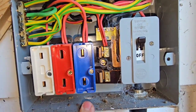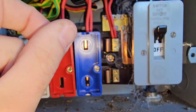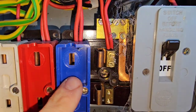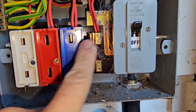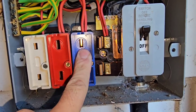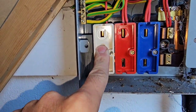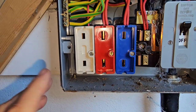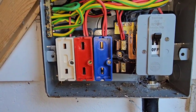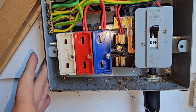Behind here you'll notice it's a double screw terminal, so you've got two chances of getting it right — and also wrong — because I have seen a lot of them bite down on the insulation. You can move these carriers around, they're interchangeable — you could move this to there and misfuse by taking a red one and popping it in a different position. But it takes a tool, it takes getting the lid off, it takes a bit of experience. You shouldn't be doing it, but you can't just inadvertently do it — it takes a bit of effort to get it that wrong.